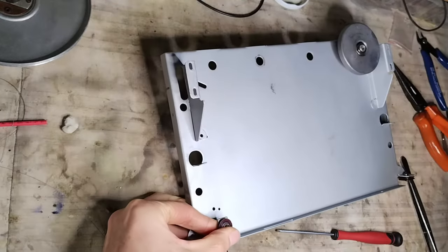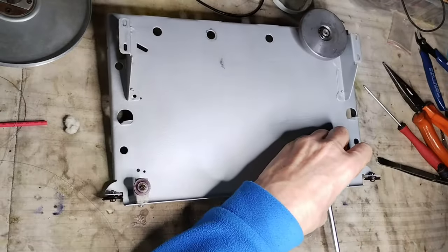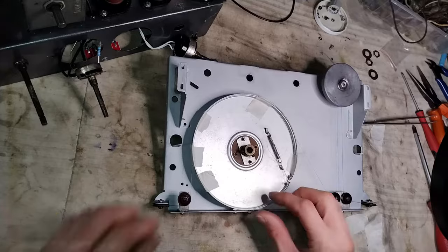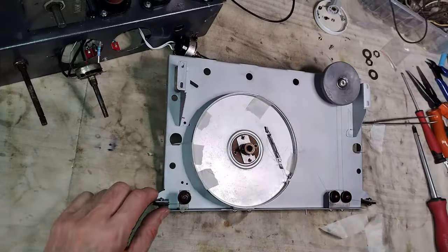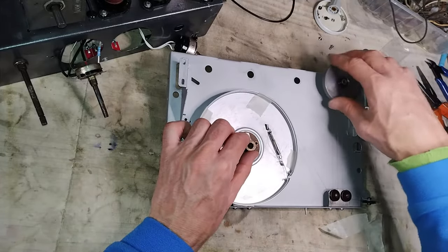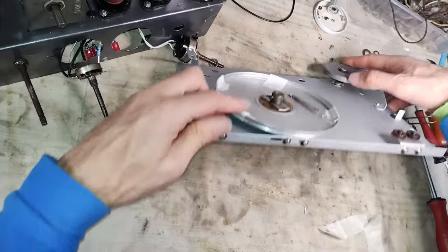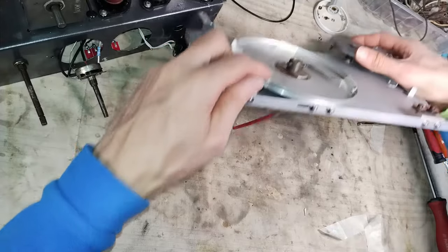Initially, the original dial cord was used because it was still intact. However, there was a problem with the flywheel shaft being very thin and not making enough friction, requiring too many turns around it and too much tension on the cord. That original cord broke, and a new one has been installed, but only after adapting the flywheel so that it could operate on a larger diameter with better friction.